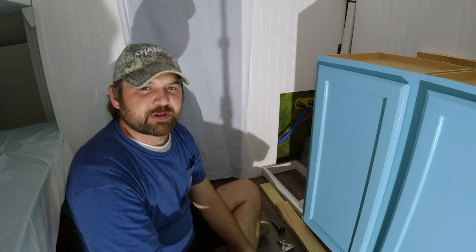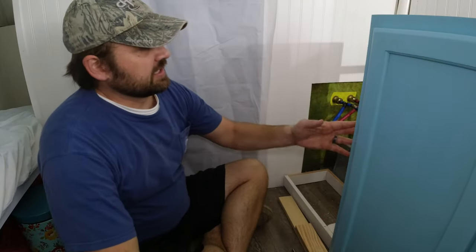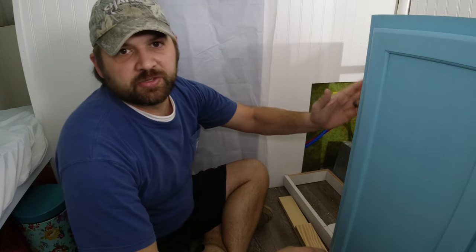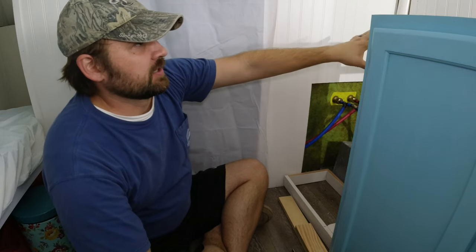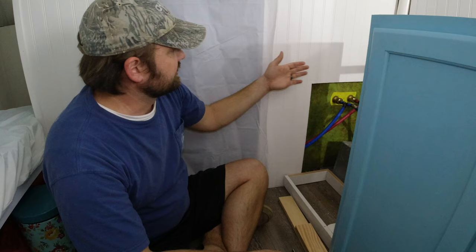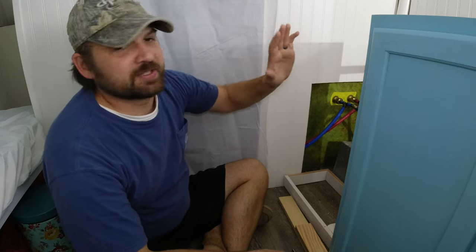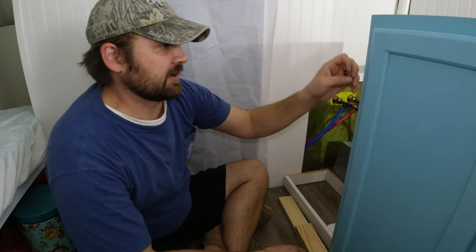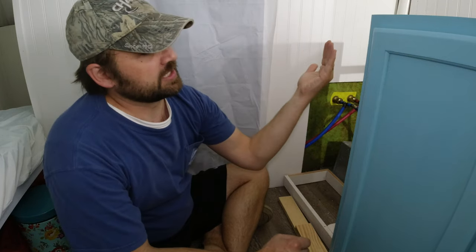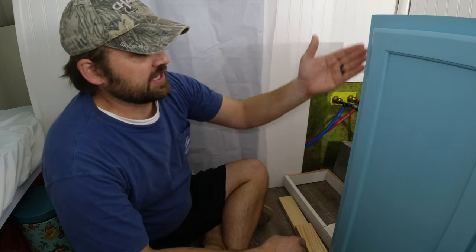So why don't you join me on this episode — we're going to be learning as we go and hopefully this will help you out in your build. So let's get started. What we're going to be doing today is building this cabinet, and we're just going to be doing two sides of it. It's going to be attached to the wall on both sides. You have the outer wall of the camper and this divider wall. I'm pretty sure those are not plumb at all, so I'm going to plumb it up to the side of this cabinet, nice and square with the floor.